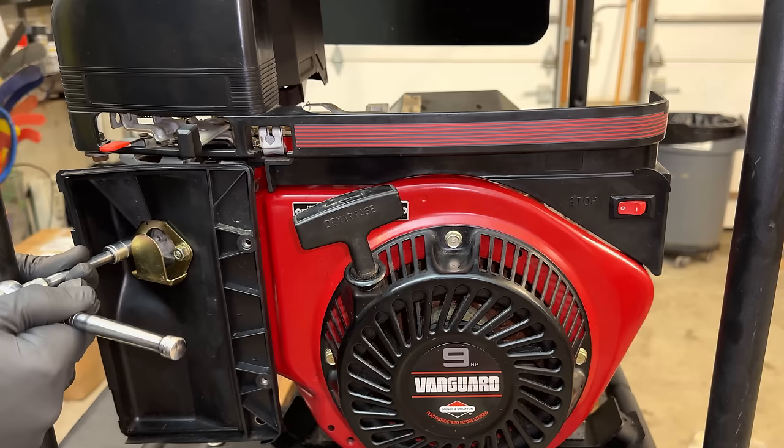Yeah, already I can see we're performing worse. We're starting off at close to 7% THD with no load, so it's only going to go higher with a load. We're now at 62 Hertz. I think it was about 133 volts. And the sine wave actually doesn't look quite as clean as the brushless generator did. Anyway, let's see how it does under a half load of 2500 watts.